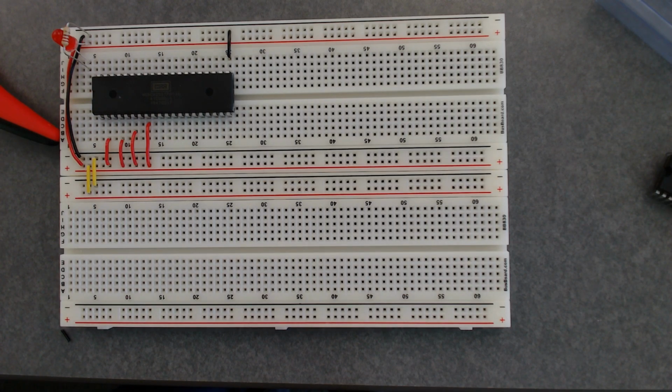Okay. All right, so the other pin that he's got tied high here is pin 1, 2, 3, 4, 5. That's BE. So what is pin BE? Let's go find out. Yeah, bus enable. The bus enable input signals external control of the address, data, and the read-write buffers. When the bus enable is high, the address, data, and buffers are active. When low, they're set to high impedance status. So we'll go ahead and tie that high for now. That's pin number 36.